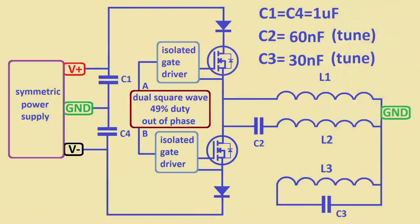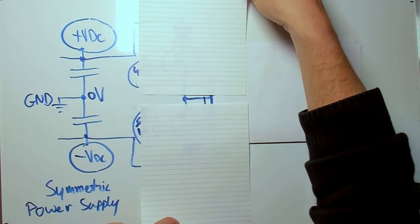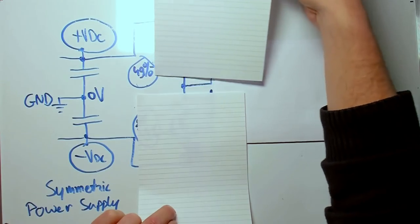My L1 coil produces both polarity impulses. This can be done very easily by grounding it on the outside rim while providing the inside rim with alternating voltages. Therefore, I now use two N MOSFET switches that are alternately opening and closing. One is turned on, then it is turned off for the 1%. The other is turned on and it is turned off for 1%. The other turns on again for the next cycle.